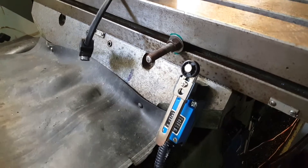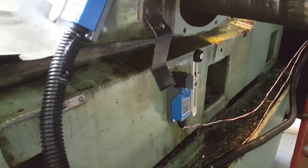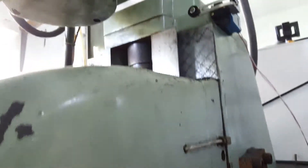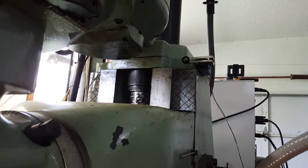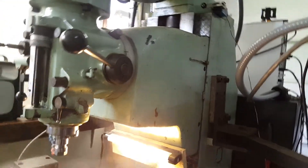I put in the home switches for it so it homes itself now. That's the limit, that's the home back there. It just uses the old tongue for where originally the home thing was, but it's not working right now. You would have just eyeballed that so it lined up, and that's on every axis. I put these switches in but I could not get that switch up there to work properly — it keeps going in the wrong direction every time it tries to touch off home, going down instead of up.